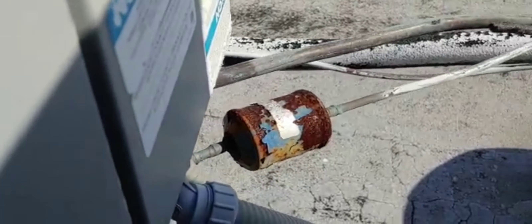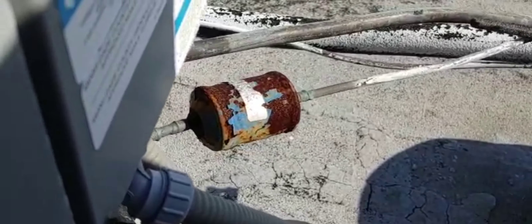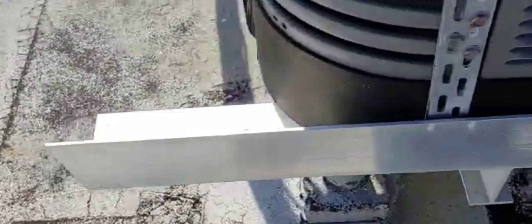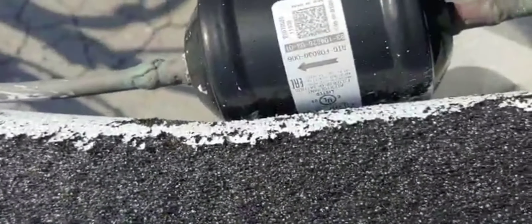Of course then you've got to vacuum the unit and replace the dryer, so it's a pretty expensive repair — like four or five hundred dollars, at least $400, depending on how much freon is in your system. Especially here — we're on a condo that's nine stories high, and there's sometimes a very long pipe between the unit and the inside air handler.